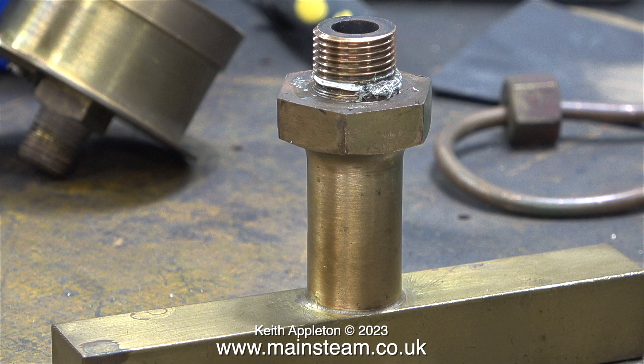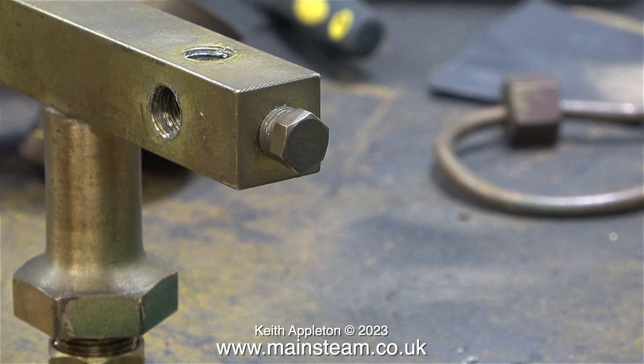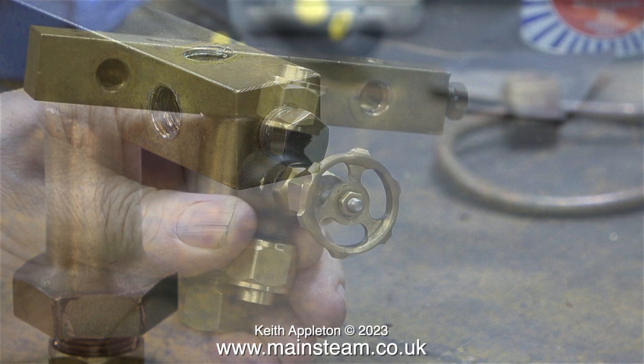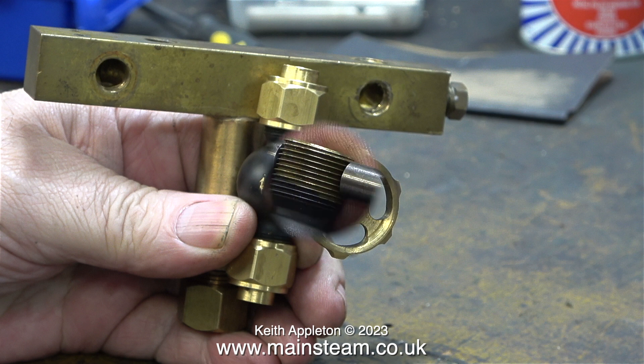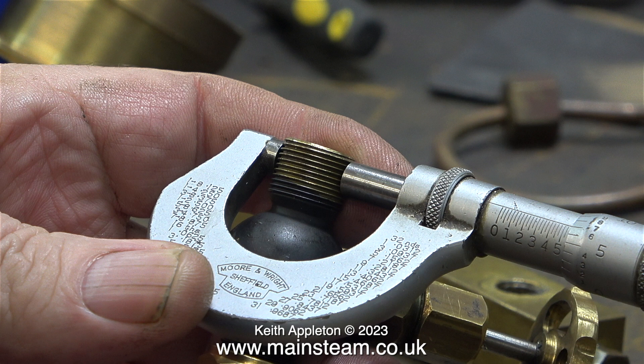This puzzled me — the thread is phosphor bronze, it's a different colour, and if you look closely it is a thread insert in the brass part. Perfectly permissible. This is okay because phosphor bronze is stronger than brass and less prone to de-zincification when it's screwed into a steel boiler. I think I'm probably going to make a new turret, or I'll modify this one — I'm not sure yet. I could actually cut this one up and put this valve in the centre; that would give me the isolation that I need and it would look very steam-like. Some valves I've seen don't look steam-like at all — they look like they've come off washing machines, and I'm trying to avoid using that type.